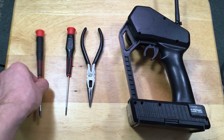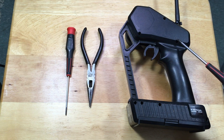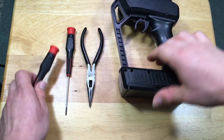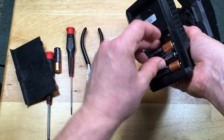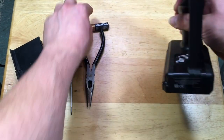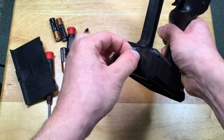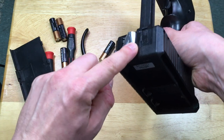There are only five screws. They are all Phillips head hardware. You have two screws here on the sides, and three here on top. I'm going to take them out and then we'll open up the remote itself. When doing this, also make sure to remove the batteries. There is a sticker here in the front — this sticker holds both of these pieces together. You have a molded piece of plastic, so I'll just take the sticker off a little bit.